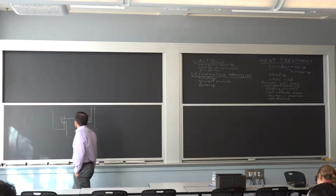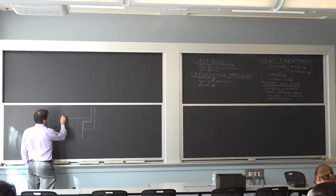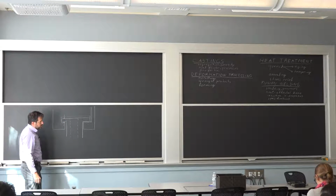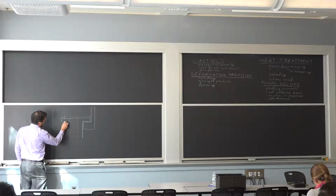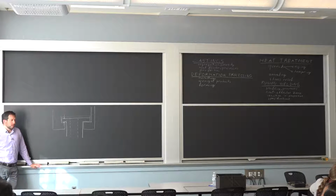So how could we do this specific molding to avoid it? Thickening the flanges is one parameter to avoid the bending here. And then what you'll see me say a few times today, as I try to get a focus for each lecture, is why did they not put a good, nice radius there to prevent high stress concentration?